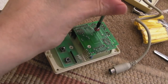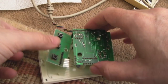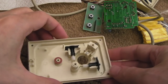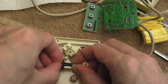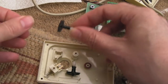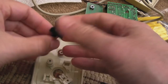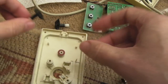If you move it frantically you can kind of get it to scroll - it's exactly the same problem where the ball is ultimately worn. Now the balls on these are 20mm. No other mouse to my knowledge has a 20mm ball - this is the problem. You can buy on eBay ones that are somewhere between 21.5 and 22mm, but these are 20mm. So I'm going to pull these rollers out on this one. These are smooth probably from wear. I'm going to do the same thing on these. It's just cut the piece of heat shrink the right size, slide it over, just heat up - 100 degrees. You don't want to go hotter than 100 degrees or you will melt everything.